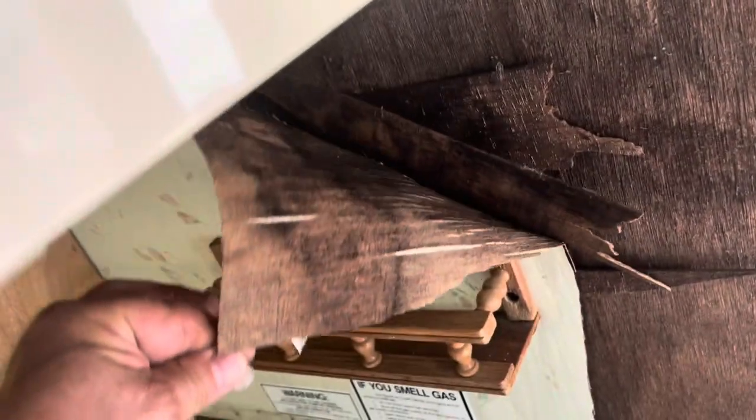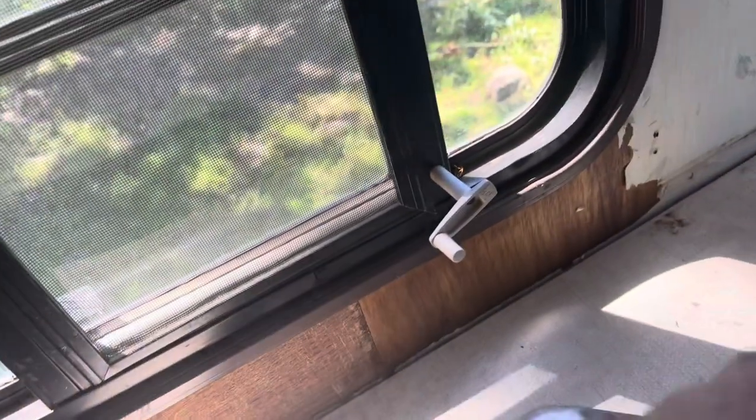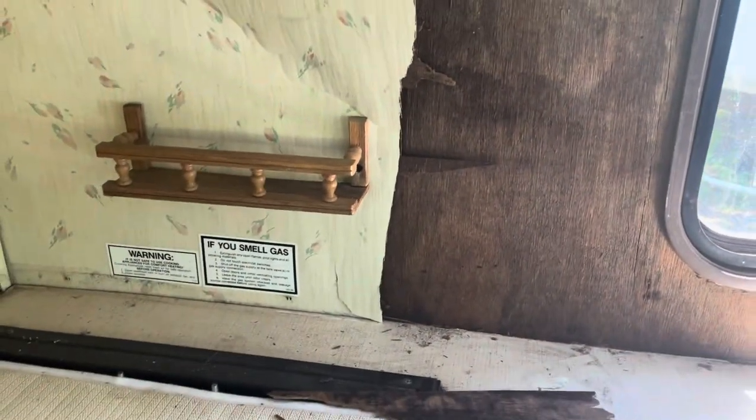There's a mystery behind every surface in here — you peel just one layer off and there's rotten plywood a couple of layers deep underneath. We're going to try to shave this all down to where it starts adhering, cut that off, and just plane it out to where it's normal plywood again. Then I'm going to try to lay some tile in here to try to permanently waterproof it, hopefully.